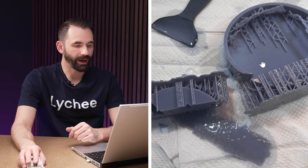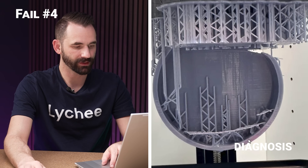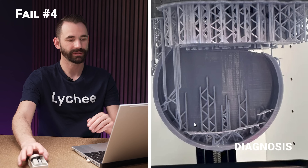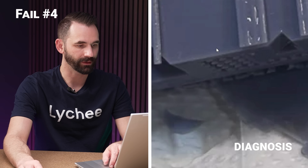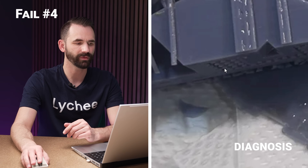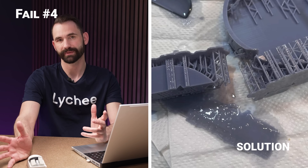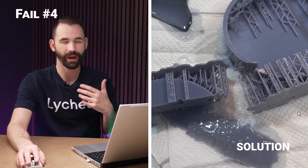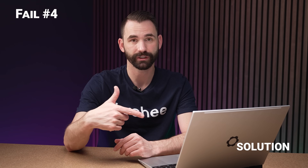On this next one, it looks like we've got a print that failed halfway next to one that only failed partially. There are some supports at the bottom that were supposed to connect. Looking inside, there's something like a lattice structure infill. You really don't want to use that for resin. If you do, make it sparse and definitely make sure you have hollowing holes. This is an issue of suction cups — they create pressure when going into the resin and coming out, creating very inconsistent layer thickness and lots of issues. Resolve the suction cup problem and you should be good to go.